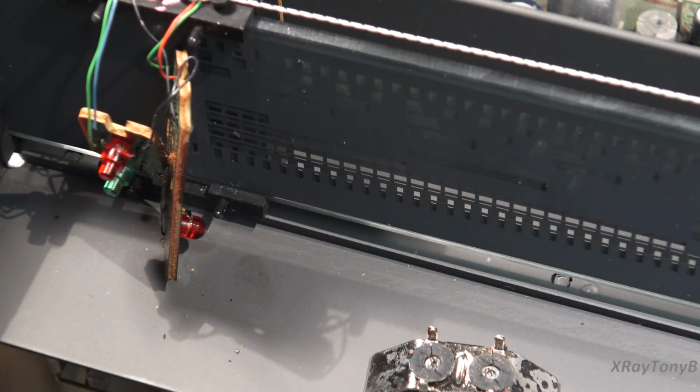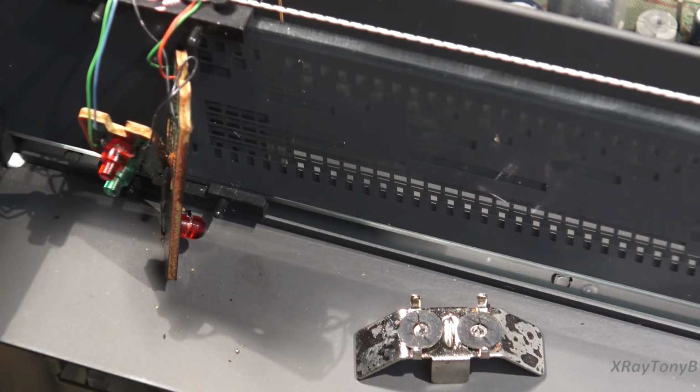Well, I have a couple of concerns. Incandescent bulbs, if there's any kind of a pulsing DC going into there, or AC as it were, that's going to be kind of canceled out by the filament of the bulb. And if you put an LED and there's the least tiny little bit of flicker, what is that going to do to that digital word going into the PLL? Is it going to cause the PLL not to lock? I don't know. I'm overthinking this, but I'm doing it because we get one shot at this.